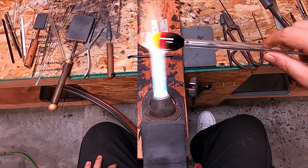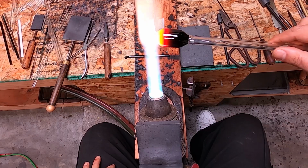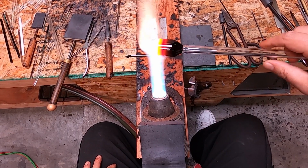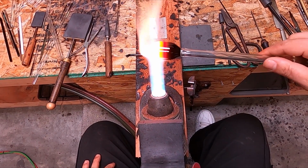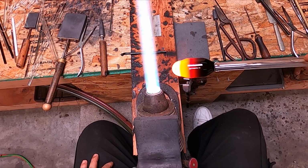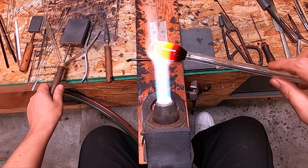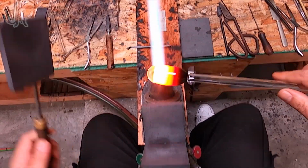By blowing it out slowly, you can really see where your heat is in the glass, what wants to expand and what doesn't. And that way you're able to go back in and apply heat appropriately. You give it that air. Okay, we're about to cylinder shape, so I'm going to stop, give it another heat, and bring it to the marver to finish out that cylinder shape.